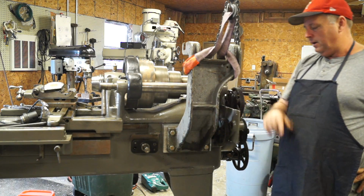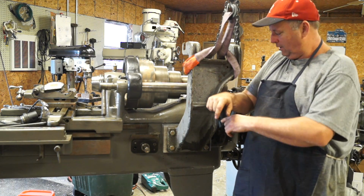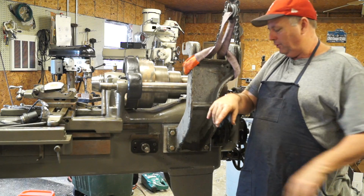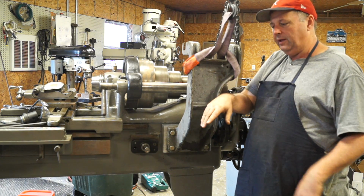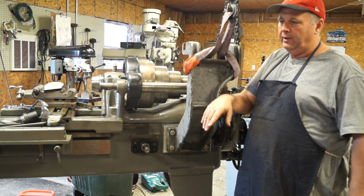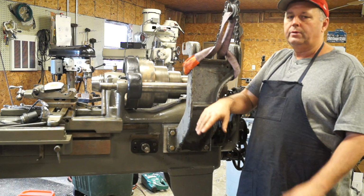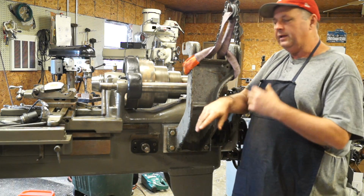So what I've got here now is I've been working getting this set up. This thing was fun. Whoever had put this part on the other lathe, apparently they just hand drilled a hole. So there's nothing consistent, measure them out. You basically have to mount it. I figured out a pattern, put it in a program, kind of took an average of everything, and mounted it up, drilled and tapped, made the part, and I hit 3 holes.